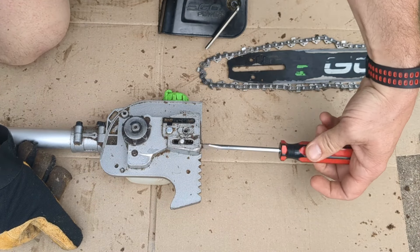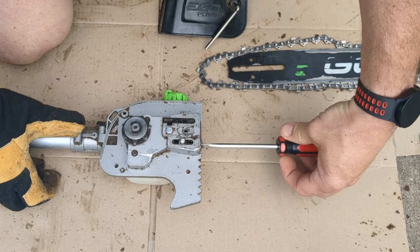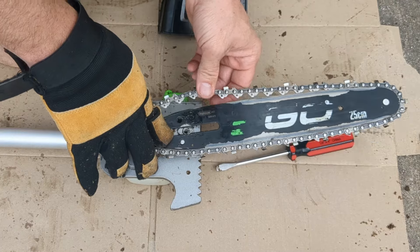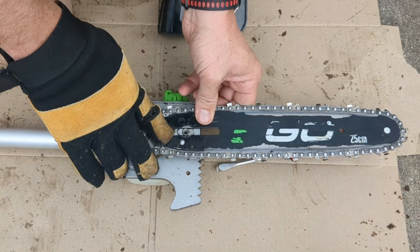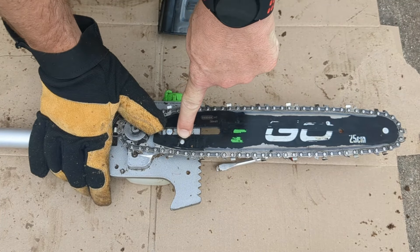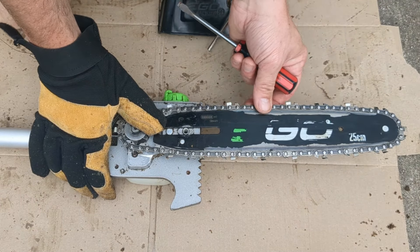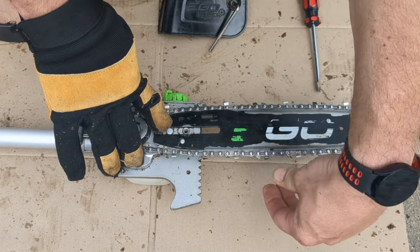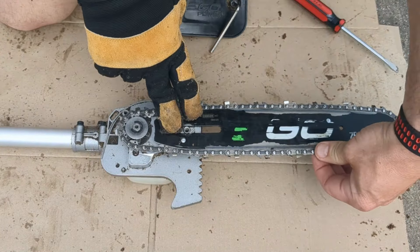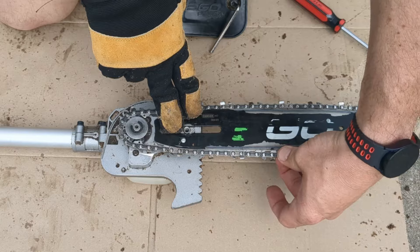I want to show you the chain tightening knob — as I turn this screw you can see it's moving closer to the wheel and further away, and that seats into the hole of this bar. You want to make sure that the middle piece is seating right here, and also make sure that this tightening knob is seated. As you are tightening or loosening it, you should notice it's taking the slack out of your chain. You want to make sure that the chain can move freely but you don't want too much slack.